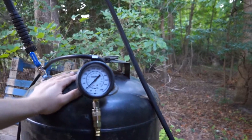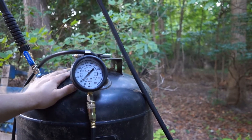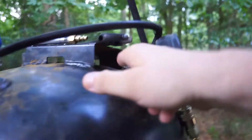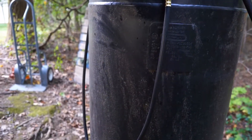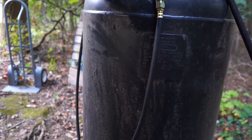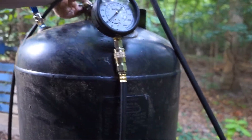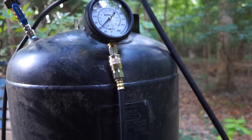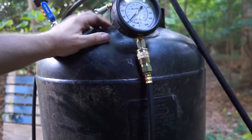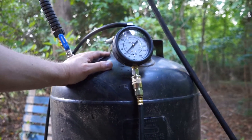The deal is that water is not compressible, so it doesn't store energy. I have this filled with 60 gallons of water. I found that this fitting is the highest and — you probably can't tell — but I've got it on a slightly uneven surface, so the two fittings on this side are actually the highest right now. Before I hooked up the gauge, I actually popped this into the quick connect, pressed the trigger down, and you can see it's full of water. I ran water until it was filled all the way up to the top, so hopefully I have none or very little air in here.